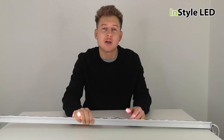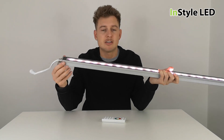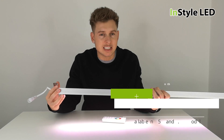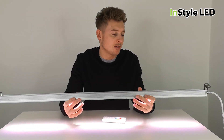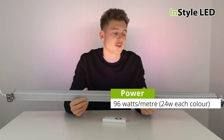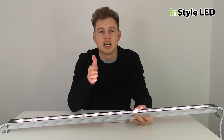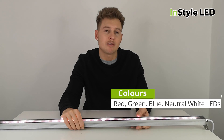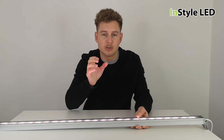In this video I will show you our RGBW wall washers. These are available in half a meter or one meter lamps and compared to LED strip lights are a lot more powerful. This RGBW fitting is 96 watts per meter, using 24 watts per color — 24 watts on the red, green, blue, and white. The white is a neutral white at 4000 Kelvin, allowing you to mix colors to select warm or cool whites.